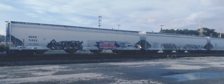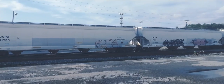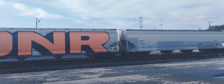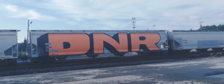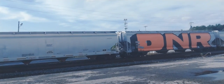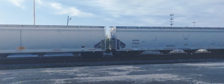Now, there was another rule where when you made a stop, you were always supposed to condition the brakes. So even if I could get the train stopped with the locomotive brakes, regardless if I use the train brakes or not, I'm supposed to condition the brakes. And what that is, that's applying 10 pounds of air. So the brake pipe pressure was 90 pounds PSI per square inch. And what you would do is just grab 10 pounds of air. And then as soon as the brakes applied, you'll knock them off. And then it'll release the brakes. That was a rule.